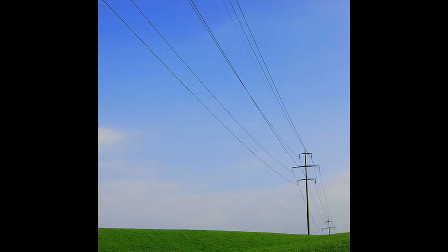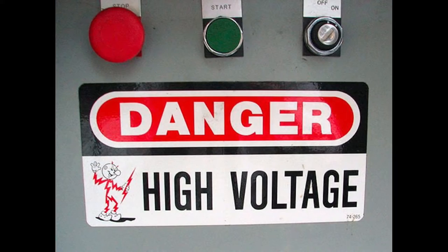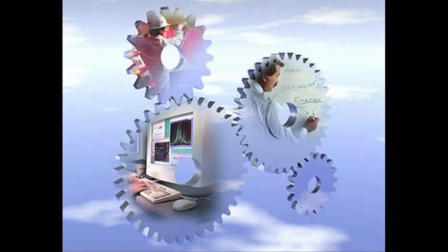If there's too much tension, the wire will break prematurely. And if there's too little, the wire will sag considerably in icy conditions and sway in the wind. Both of these situations are very dangerous. As a result, there was a need for an engineering solution to improve the existing situation.